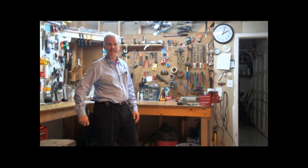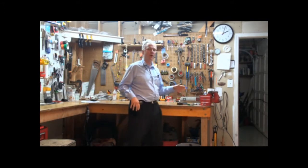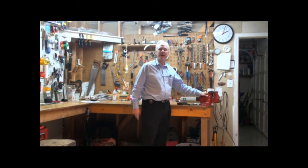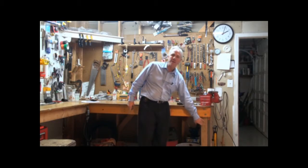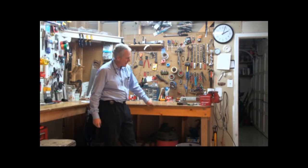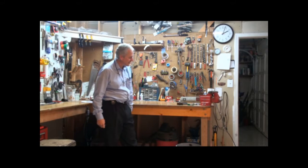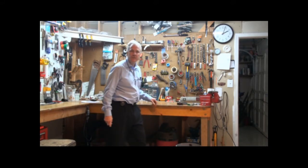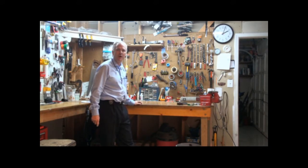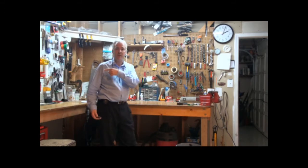This is an example of a custom-built workshop that a teenager could build. Obviously, we start off with a nice heavy-duty vise that's sitting over a 4x4. We use very heavy-duty 3/4-inch plywood and fairly stout beams here made out of 2x6s. Very easy to bolt it together. This took me about maybe 3 or 4 hours to build and cost maybe $150 worth of material at the absolute most. And that's including the bench over here on the side.